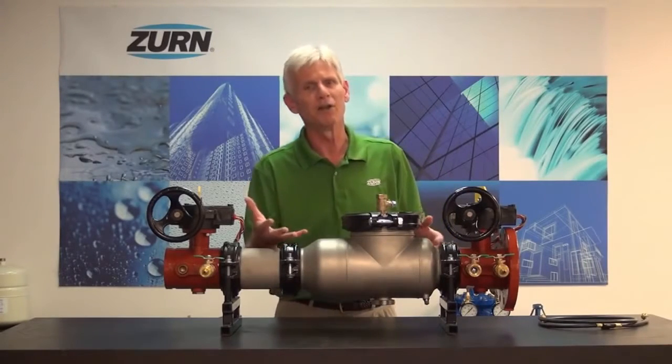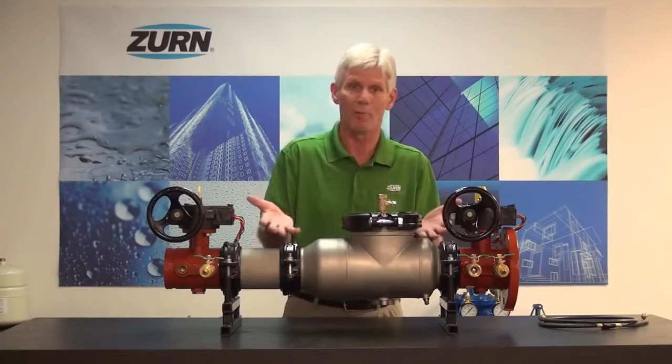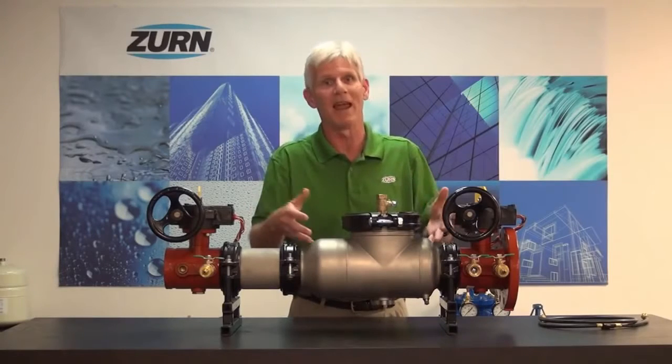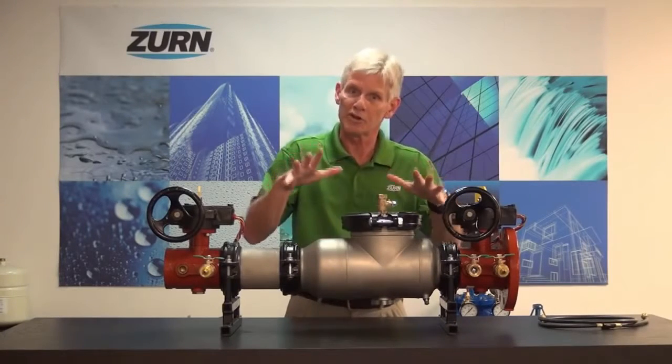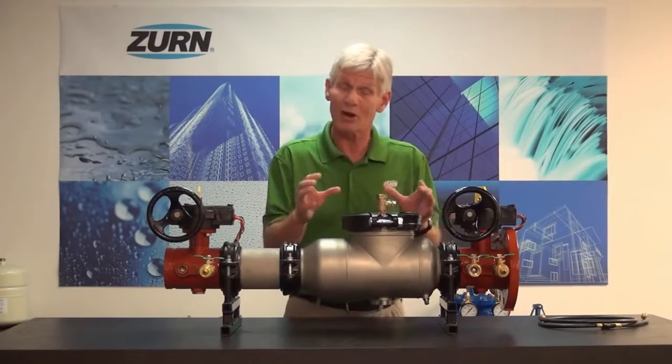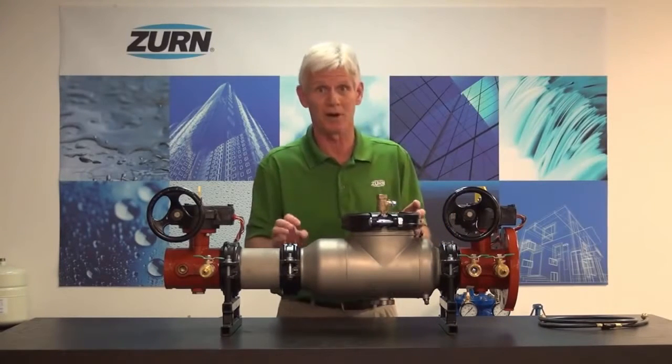What happened was a fairly new tester, backflow repair person, was having a little bit of a struggle getting the check out of a 350 AST. Now, there's a certain procedure that you want to follow. Most of it seems like common sense, but quite frankly, there are a couple of things that you have to do or it does make it very difficult.